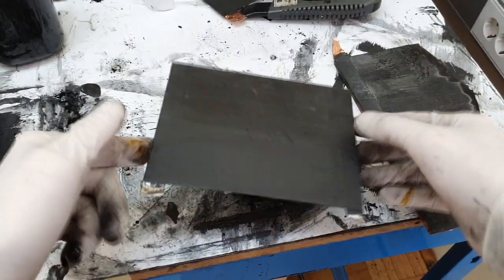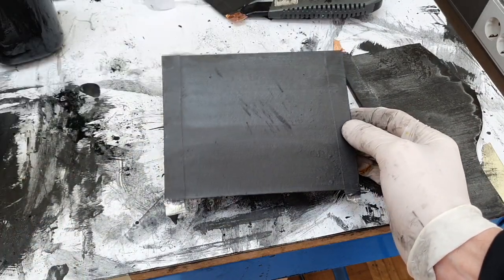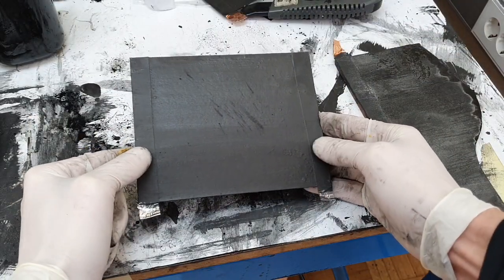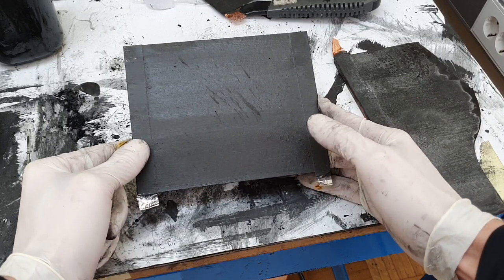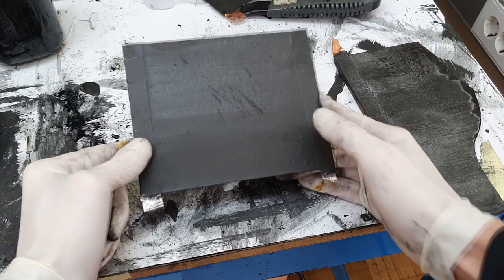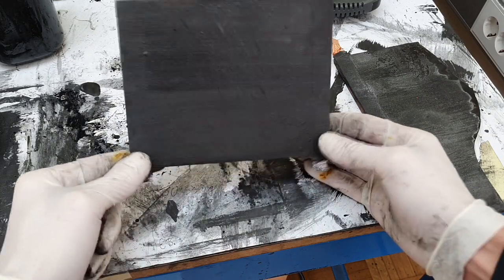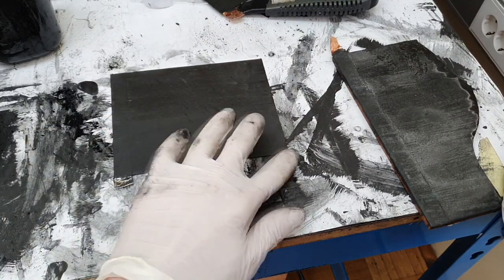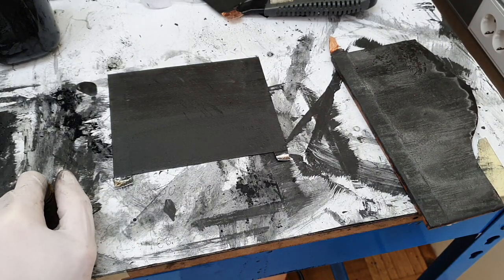I made new prototypes of these heaters, and when I apply a really tiny coating on this prototype heater, the conductivity was really, really good, but the resistance between the aluminum strips was too low. So my aimed resistance between aluminum strips is around 100 ohms to 50 ohms.